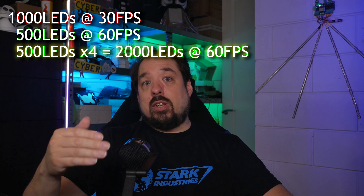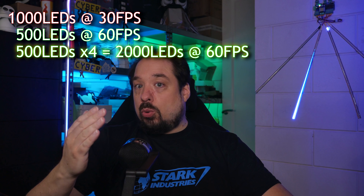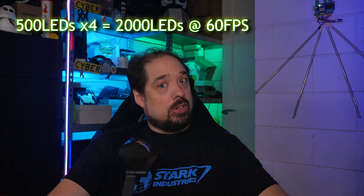Okay, back to the video. The reason you want multiple output channels is the WS2812B protocol that is used to address all the LEDs. This has a limit in speed and amount of LEDs. Basically, if you'd want to run 1000 LEDs, you are down to about 30 updates per second per LED, or frames per second. I generally advise people to stay around 500 LEDs in total, because then you get a nice and smooth 60 frames per second. With multi-output, however, those limits are per channel. That means instead of being able to drive 500 LEDs as a maximum per board, with four separate channels you'd be able to drive 2000 in total while still maintaining a smooth 60 frames per second.